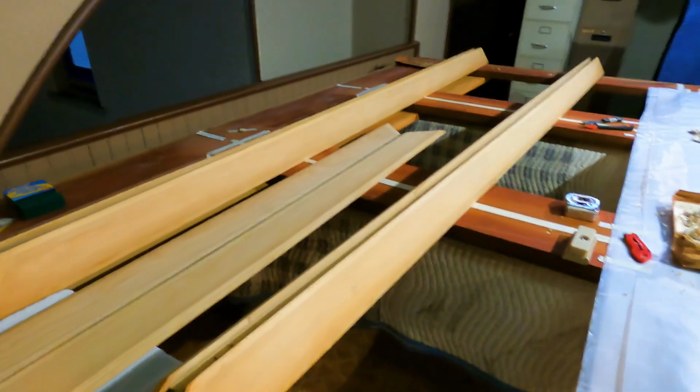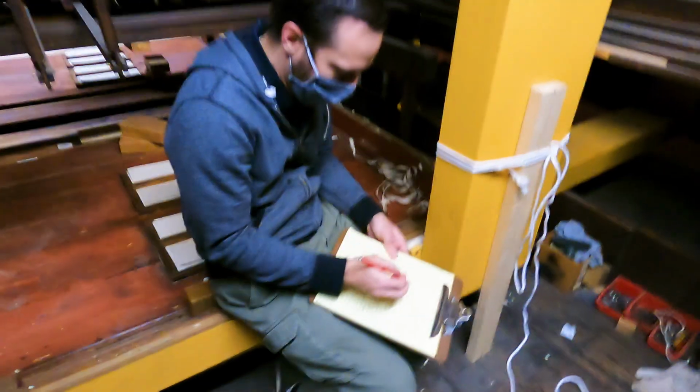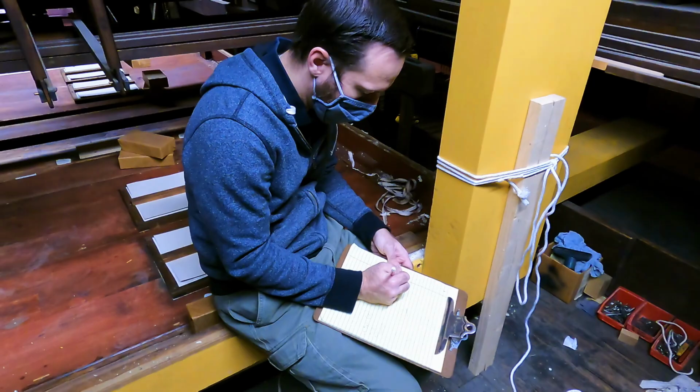Now, they've gotten all of the parts out and cleaned up, and it's time to start prepping all of the wood to be attached back together with glue. One of the first steps was determining how much the wood of the reservoir might have changed shape over the last 130 years, and if the ribs that they found on the instrument needed to be modified to work properly.